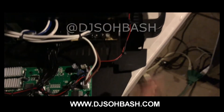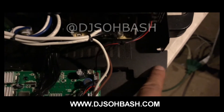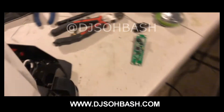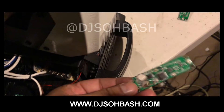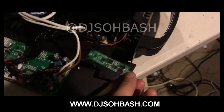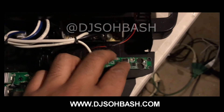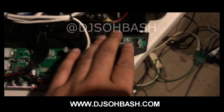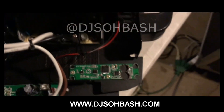We're going to mount that PCB board right here — this is probably the best area I found for mounting it. I have an extra PCB board that burned out by mistake, so I use that as a template. Put it right here, use a clamp or however you want to mark your holes, drill them, and we're going to be mounting right there.